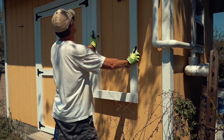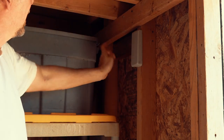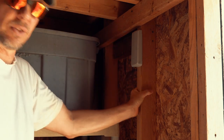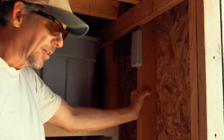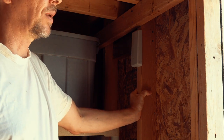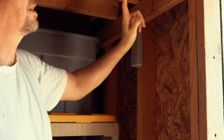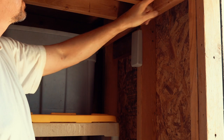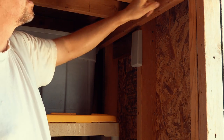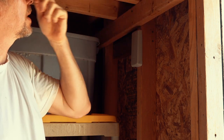That could be a fit. Here's what it looks like on the inside — there's a stud here, and I think I'll also be cutting into one over here. That's not a problem because the window frame itself is perfectly good 2x4s, so I can use them as new studs. I just need to brace it temporarily, and that might not even be necessary because there's one support piece running lengthwise over here that I don't need to cut out.